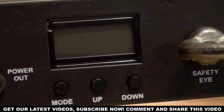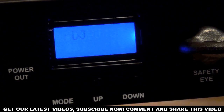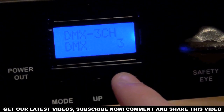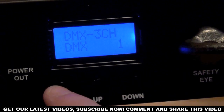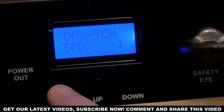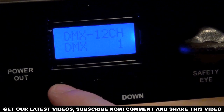Taking a closer look at the display to boot the fixture up — normally we see a four-button display, but instead we've got a nice three-button high-resolution screen. We've currently started up in DMX mode, specifically three-channel mode. Pressing up and down changes the DMX channel the fixture is on. Pressing the mode button we can cycle through the different modes: DMX three-channel, seven-channel, six-channel, ten-channel, and twelve-channel mode.